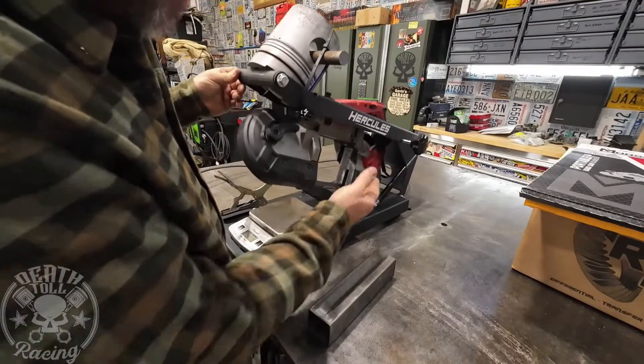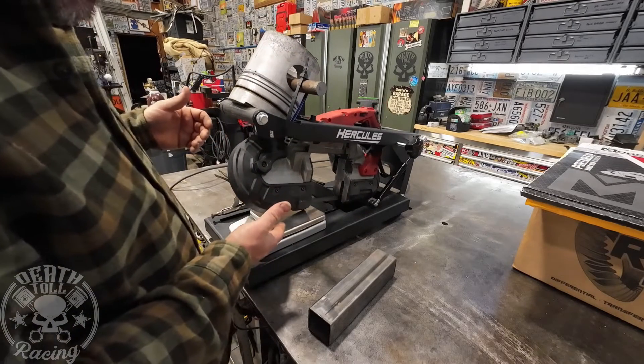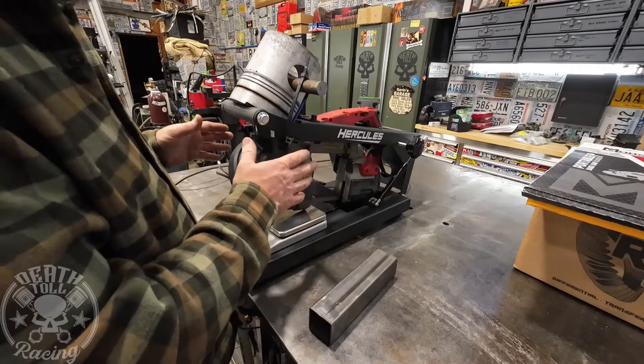I've rigged up a weight on the end of our fixture. We have the strut that we're countering, which puts down about 40 ounces on the pulley where it hits the scale. I also have a weight that can be added to bring it to 90 ounces total, and that will all come into play as we get going on the testing.